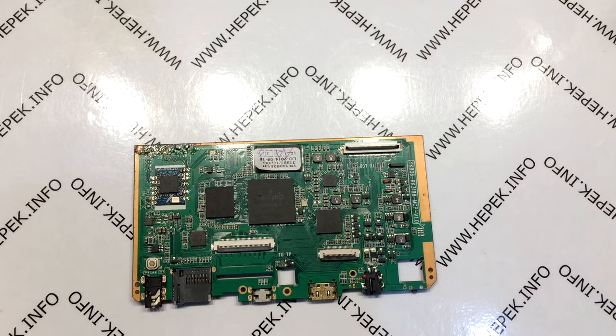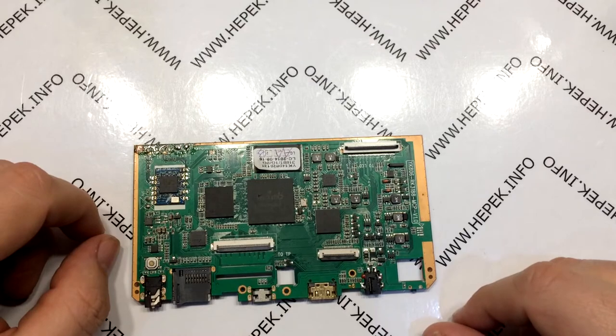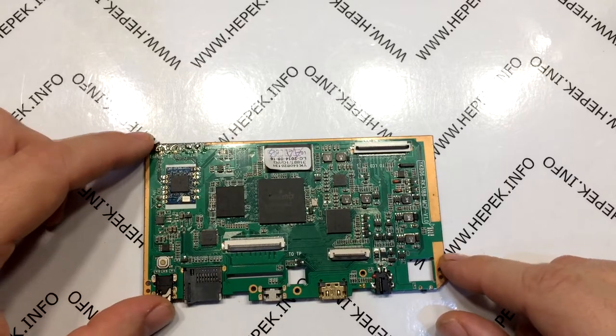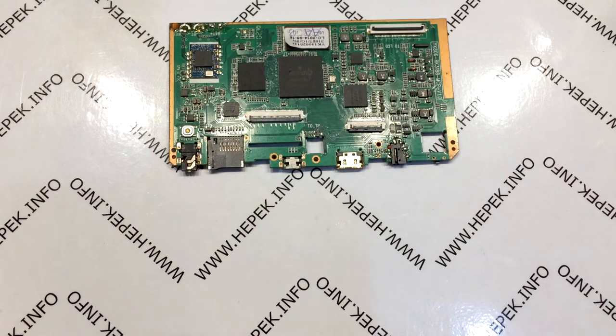I tried to turn on the device again after the firmware update with the USB charger and without the battery — I didn't get a stable power supply. I'm also avoiding USB for power since I'm planning to maybe use a USB keyboard or mouse or connect some other USB device to it. So I gave up on further attempts and now we are going to bring the power supply directly onto the battery connector.